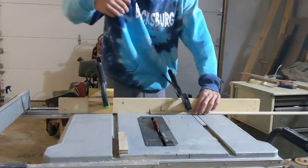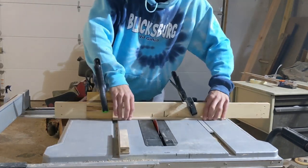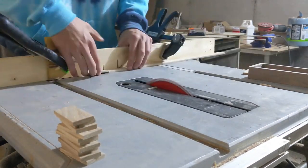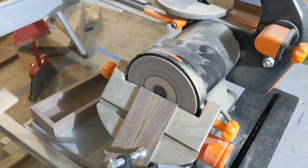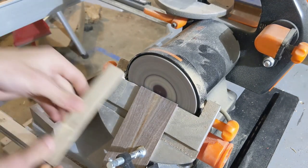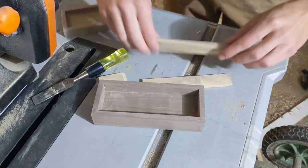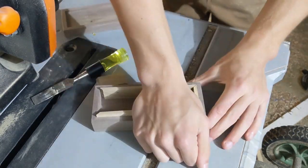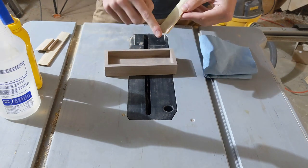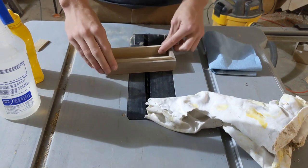This will make a friction fit for the box top and add a nice look to the inside of the box. I cut several thin strips out of this pecan wood and then cut them down to approximate size necessary to fit inside the box. From there, I used my mini disc sander to sand a perfect 45 to fit inside the box. This actually worked quite well, so much so that I struggled a great deal to get the pieces back out after test fitting them.